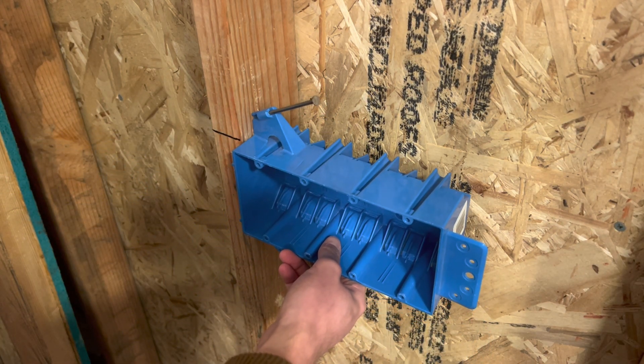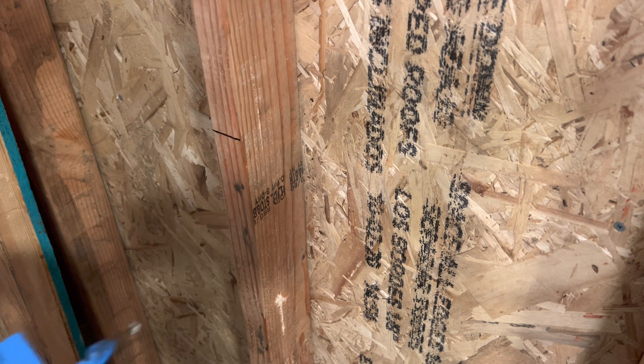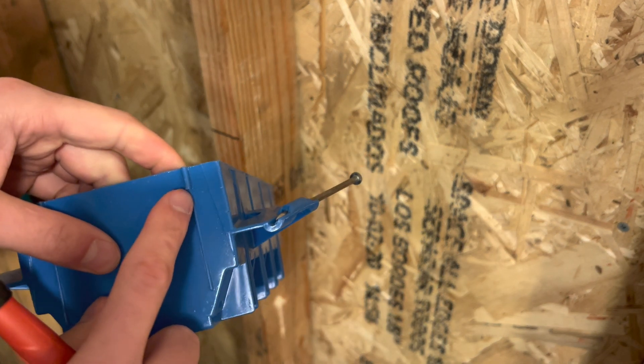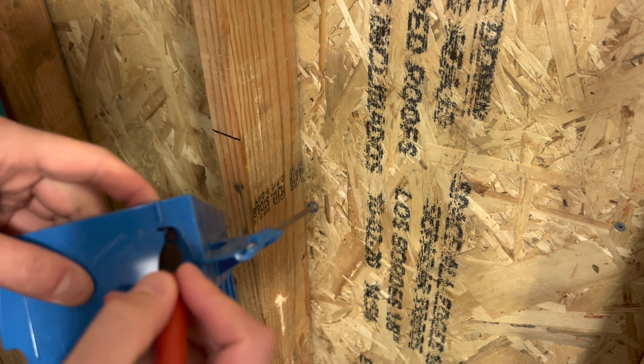The nails are going to be a little bit more solid, but it does make it a little bit more tricky. So if you're going with the 5/8 option and you are new to this, you can use these tabs for half an inch. If you are familiar with 5/8 of an inch, you can just leave a little gap, which is probably about right in here.